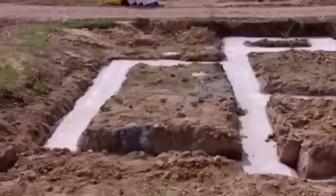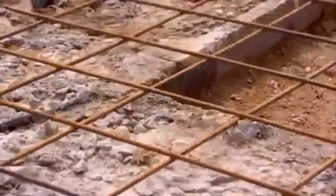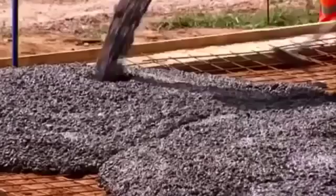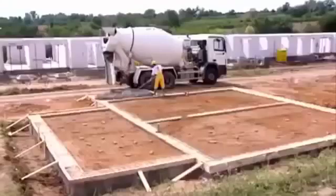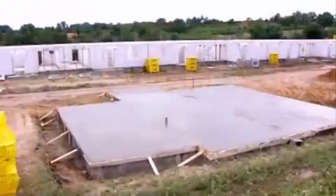Digging the foundation, compacting the base, placing the reinforcements, and concreting over the foundation plate. Of course, all the steps are vital since the quality of the foundation affects the whole building process. Thoroughness pays. Any imprecision at the beginning is hard to make up for later on. When the foundation concrete has set, you can start bricklaying.